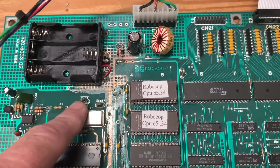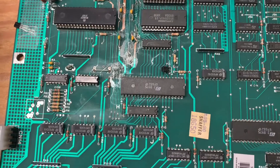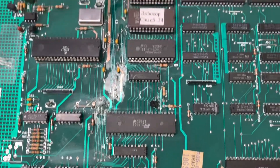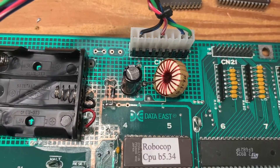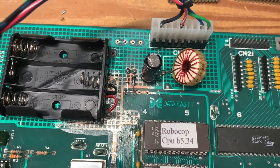There is a lot of work that would need to be done to this board to make it 100% reliable for a long period of time, and it is just not worth doing. I am going to get it working and then the customer can ride it as long as he can. I did replace the power header, this 470 microfarad cap, the 4148 and the 5817 diodes.